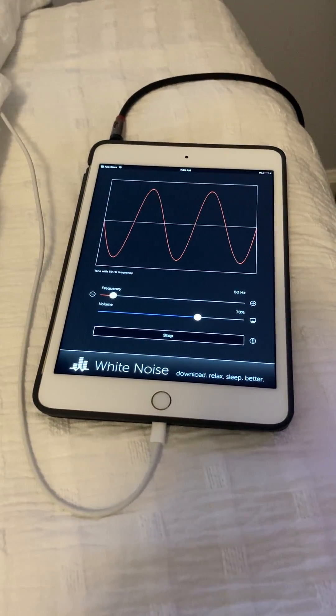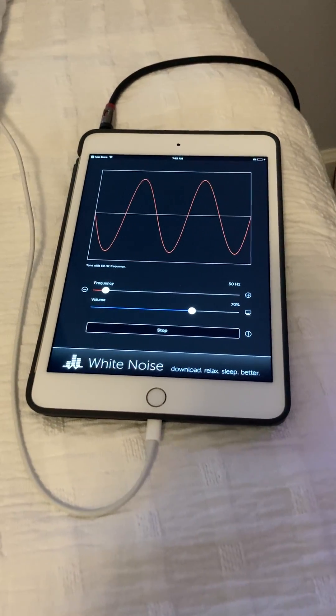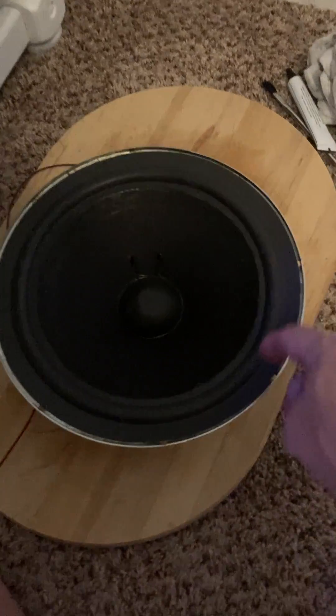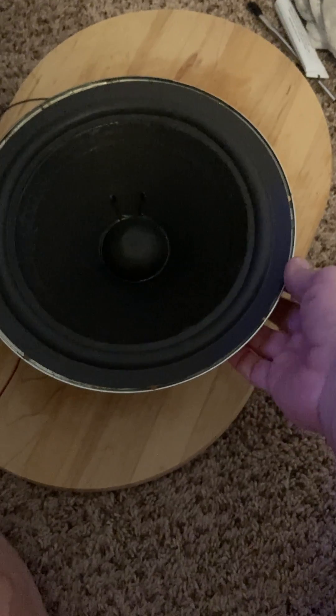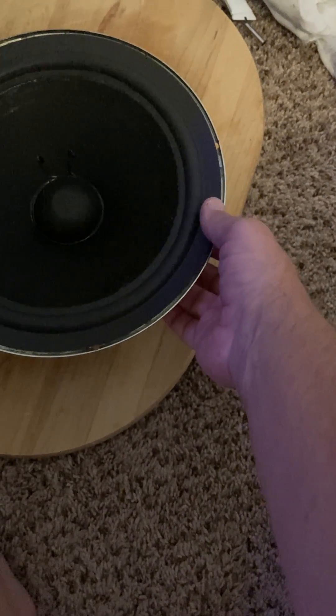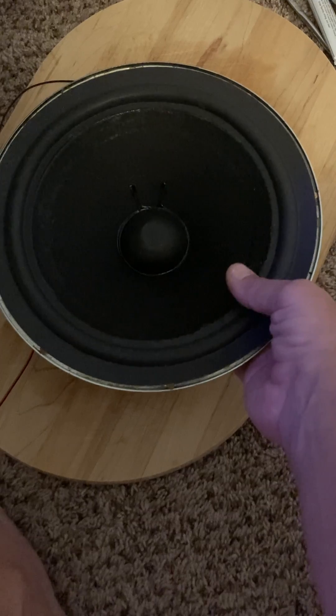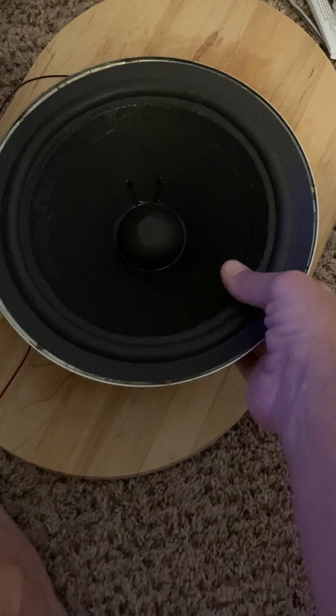Here's some rigging-up stuff for you. What I've done is I've taken a tone generator program to center the voice coil on this speaker — this is a Bose 501 woofer. I put a new foam surround on it. The only thing I haven't done is glued the outer foam. Do you hear that tone? That means the voice coil is rubbing, so that's why I did this.